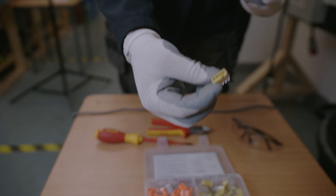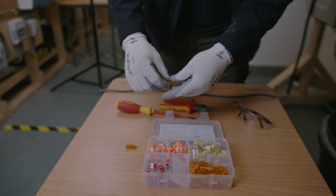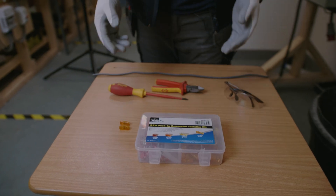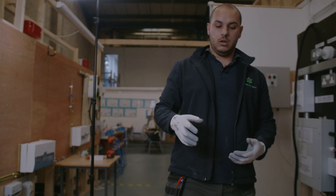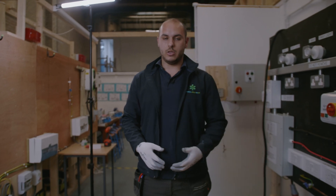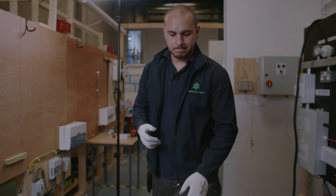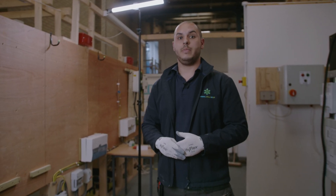It's not to say you can't use them — it's just these are purpose-made for this type of situation. We're going to need two of them, and make sure when you are using the connections that they are rated to the correct load. On this one they are rated at 32 amps, so they're going to be absolutely fine for our ring final circuit or a 20 amp radial. So we're going to use these two connections, strip the socket front off, and show you how we're going to adapt that wiring in the back.